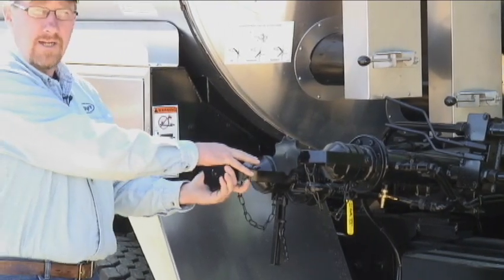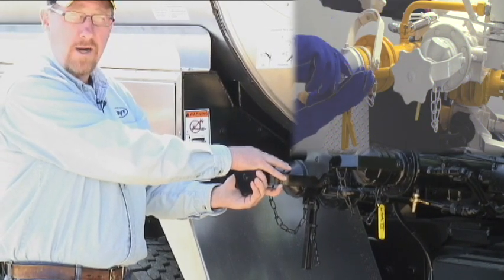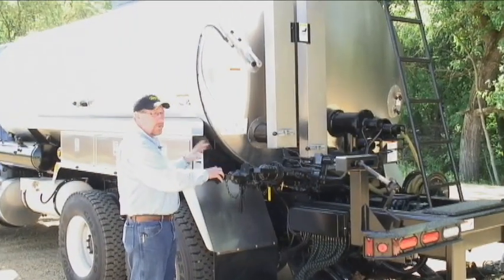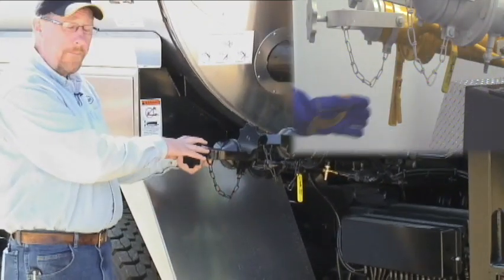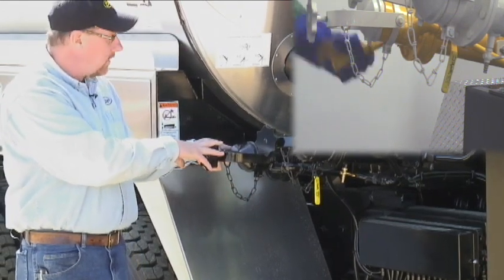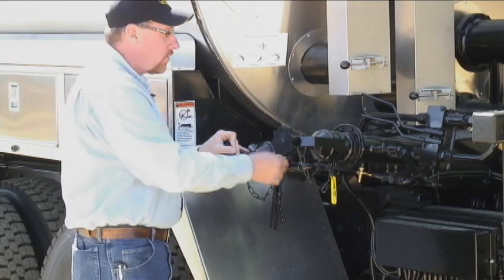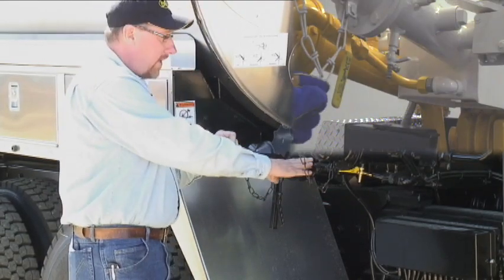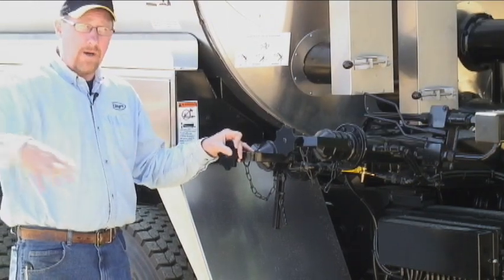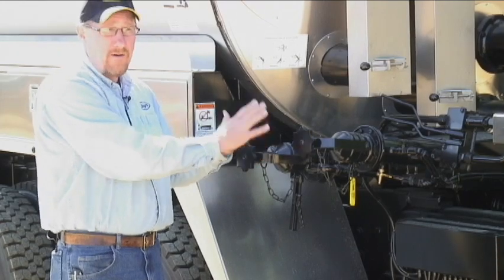The pipe to its left is a discharge or transfer pipe. This is where we would exit material from the tank either into a storage tank or if we needed to pump back into a transport. To use this, we use the controls to go into that function, then manually open this valve to discharge material. Once that operation is complete, we close this valve and it becomes suction on the pump. We change the controls to the load feature, open this valve, and that puts suction on your fill line so we can suck any remaining material back out of the load hose and put it back into the product tank. Then simply close that valve and you're back to the beginning.